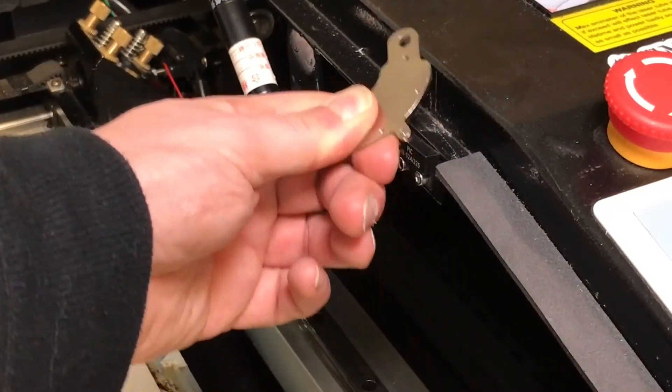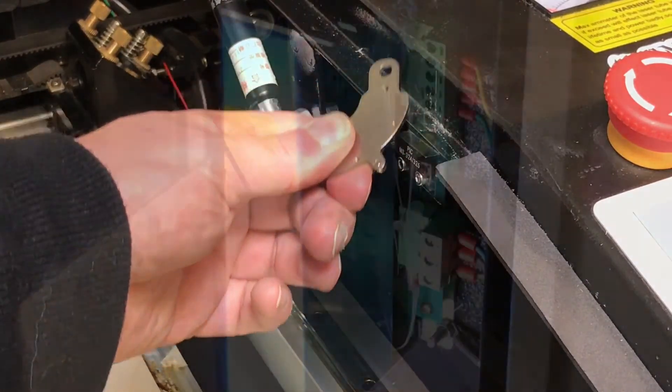Locate the high voltage power supply inside your cutter. Often power supplies have an indicator, commonly a yellow LED, that will be lit if the interlocks are engaged. By turning your water pump on and off or by opening and closing the lid on your cutter you should see the yellow LED flashing on and off. Here I'm using a magnet on the interlock switch to turn the yellow LED on and off.